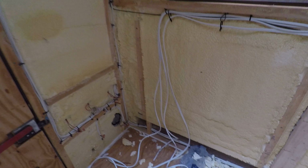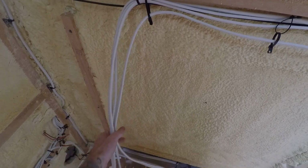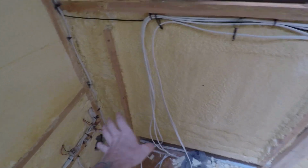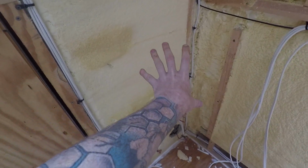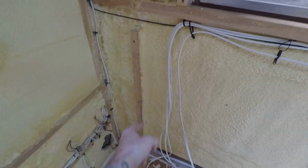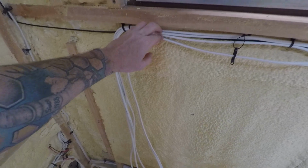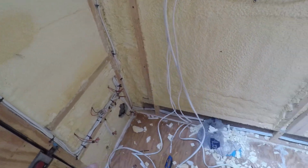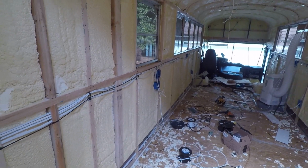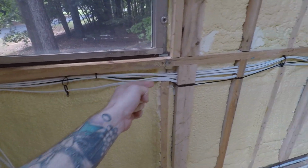On the left side of the bus, we come out here because we're going to have that dividing wall. It goes across and it's going to connect into the battery, but some of the stuff is going to connect here. We're going to have the water heater coming in from the outside, a Harvey water heater. So there's a cable that goes there. There's also a water pump over here, somewhere over here. So I have two lines going into those to be switches. They go all the way up front, where I'll be able to turn the water heater on and off, as well as the water pump, from up front in the kitchen. That's why I have two lines there.